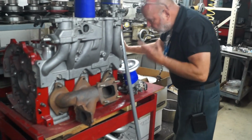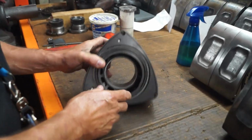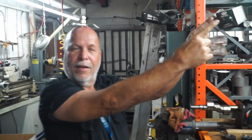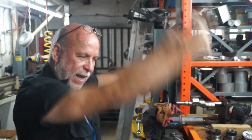Well, I grabbed one, but it didn't look right. This rotor required. Oh, anyway, back up. Normally, when you have an out of balance condition, you might have on the part on one side the weight over here, and on the other side opposed, or maybe at this angle, or maybe at this angle, but never on the same angle. So that acts as a sling.